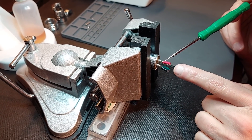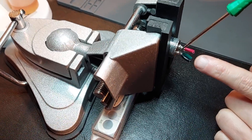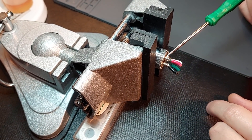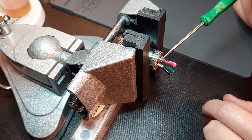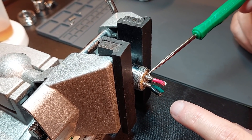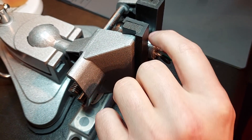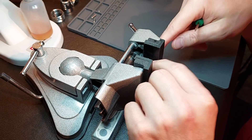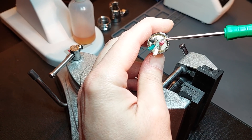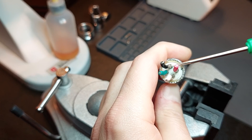In this portion of the video we're going to be looking at what these connectors look like — how everything has been contacted as far as soldering, any tinning issues — and then I'll remove all of these conductors, tin one of them, and show you exactly how it should look when it's properly soldered. So I'm going to dismount the connector. I've already dissected the cable attached to it, and you can see here we've got a gap. This is very common when you do not have proper tinning on your conductor.